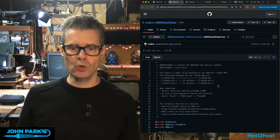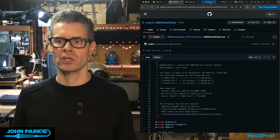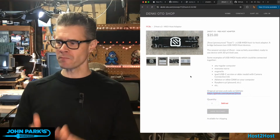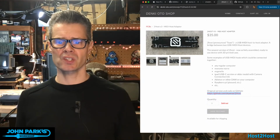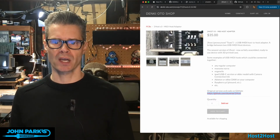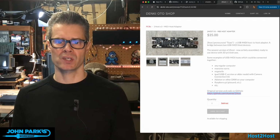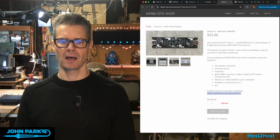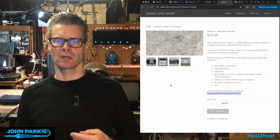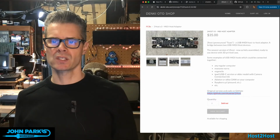So there have been a few cool versions of this. One I know of also from Steve, who made that Norns shield I showed, is this one right here called Toast, which wins for best name. And this is the same idea. It's very similar actually to what I'm going to show in that I'm using a couple of QT Py RP2040s, and Steve made a custom board that has 2 RP2040s on it. I think he uses optical isolators and essentially does the UART MIDI in the middle with the USB on the sides.